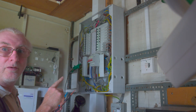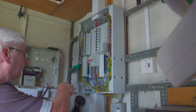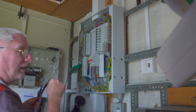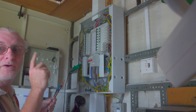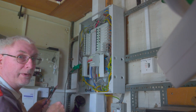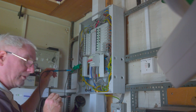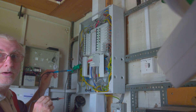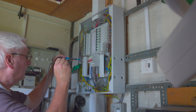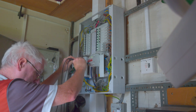You're doing it three times and you take the highest reading. I've got my crocodile clip on the earth. I know I'm doing potentially parallel paths as well — I know I could take off the earth cable and do it that way, but if you want to do it without risking parallel paths, you take out the main earth. I'm going to put this probe on the neutral and do the first one. I've set my tester to automatic, doing the three-lead test. So we've done the earth first, neutral next, and then we're going to do L1.